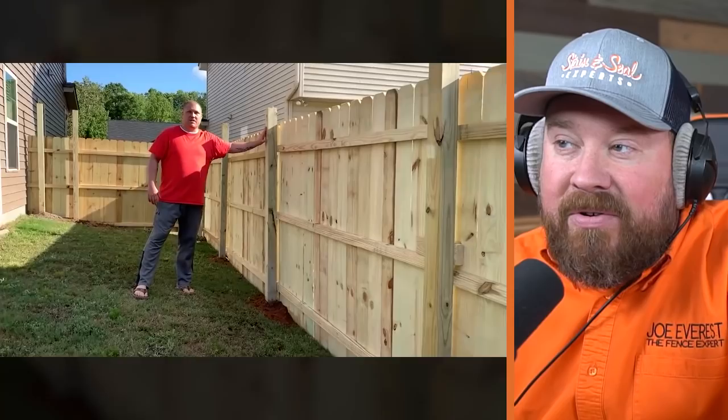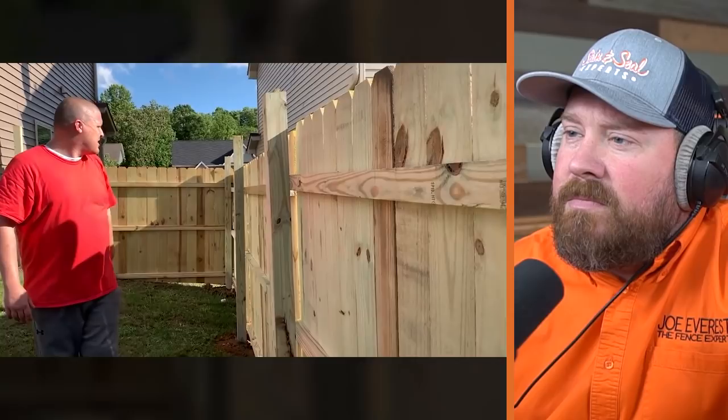The way he's shaking it, I would guess there's not concrete around it. They might have subscribed to the dirt-pack method. But even if there is concrete around it, it shouldn't move like that. The concrete hasn't set properly, and again, it's probably only a foot in the ground.